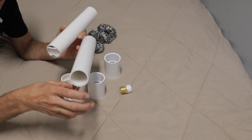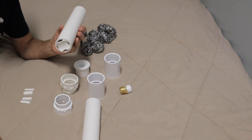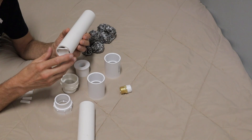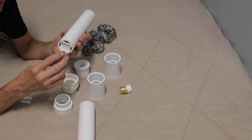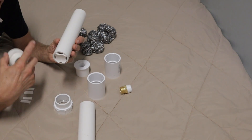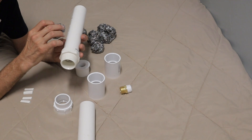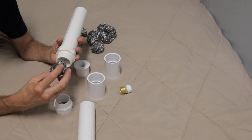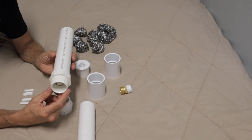I'm probably going to put a 90 degree fitting right here to make it easier putting into mixers or cement trucks — sometimes it's harder when it's just straight. All of this was really simple to build. What I'm going to do is PVC cement the baffle in the end and then put this cap over it so that everything's held in place. It'll be all cemented together, because what happens a lot of times is that the stainless steel pot scrubbers want to push out through the hole and can constrict it and make it even higher velocity. This new design is going to solve that major drawback of my other design. I'm going to put this together now and show you how it performs.